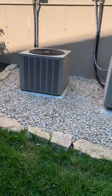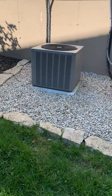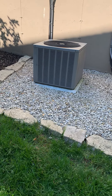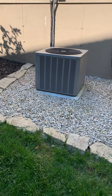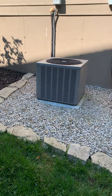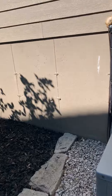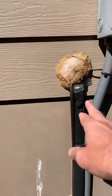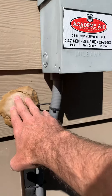Looking at the ACs — this is for the second floor. We got a two-and-a-half ton over here, and I really truly think we need to get into a three-ton, just going by the square footage, the number of registers, and the discomfort we get during those peak parts of the day. So looking at bumping up to three ton — obviously new disconnects, line set we said we're cutting and flushing, new insulation. We want to get nice clean 90s at the bottom. We got a little bit of mastic gum and putty here — just want to clean this up as well.